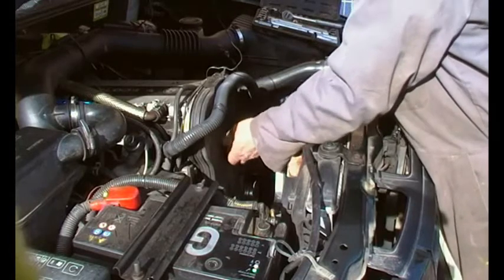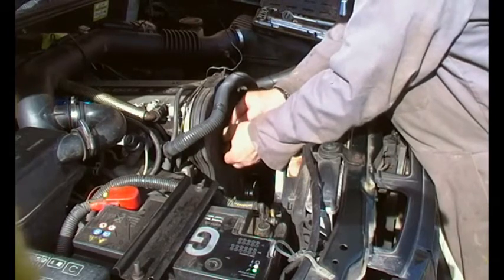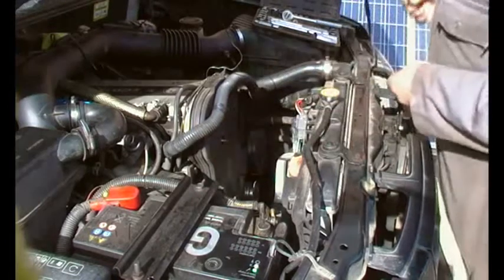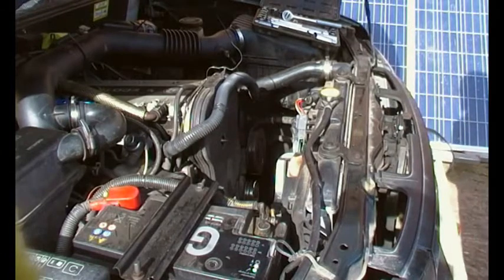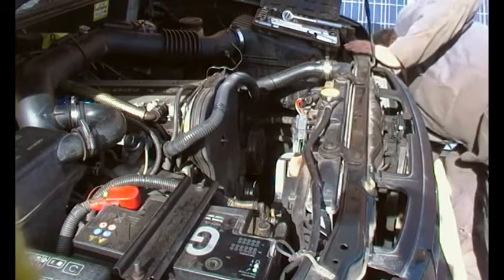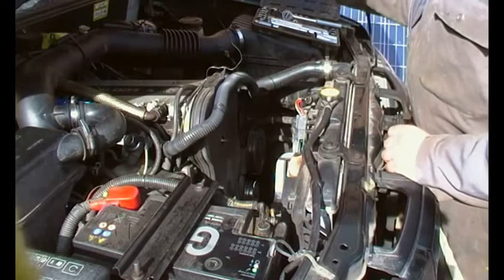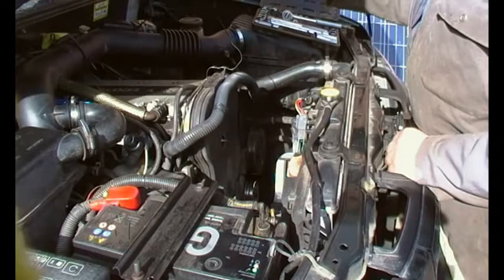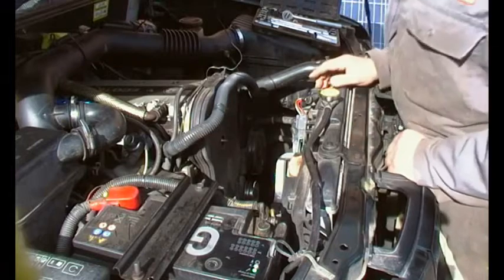You can hear the clicking of the charge controller occasionally — even though it's not very windy, there's only a light breeze. The charge controller comes on from the solar, and then the wind contactor comes in. The battery volts were going down, then the timer on the charge controller says that's enough and the volts go straight back up again and it switches back on.